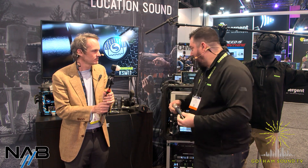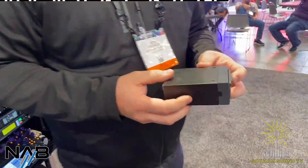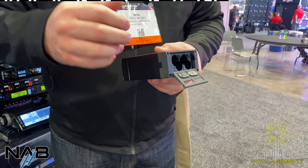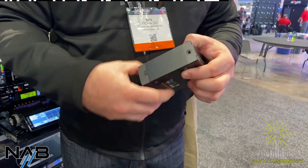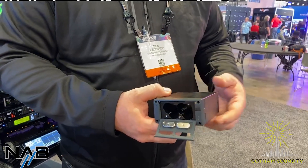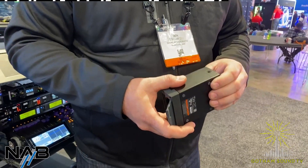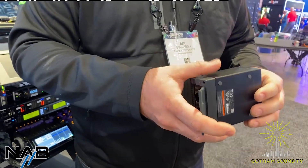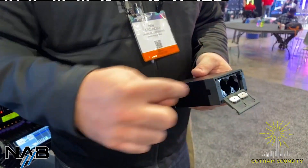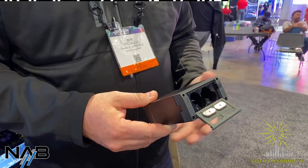For the location friends out there, we do have a new Shure battery charger — the SBC 210 LM. The LM means less module, meaning you can order this with just the housing and the adapter. It is DC powered or with the included AC adapter, so you can run it off of your bag, battery, or portable power source. It's around 12 to 14 volts nominal, and people have been using it in the field with great success.